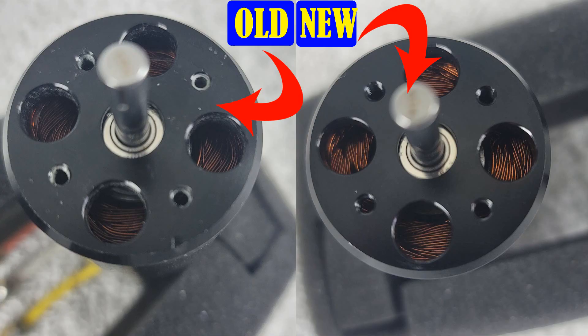So this is what we want to look at today. We're going to approach this with a visual inspection of our motor windings by placing a couple images on the screen. We can see the brand new motor with bright copper-colored wires, whereas our motor with the replacement rotor has very dark wires that look like they've been stressed. Prior to the rotor installation, I did not think the heat had impacted the windings enough to cause any wires to short out in the stator. We're going to try and identify that today using the same method from our past video, testing a brand new motor from the exact same manufacturer.